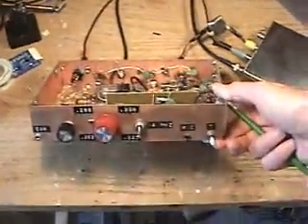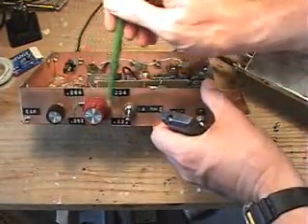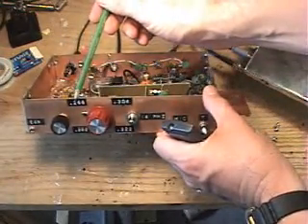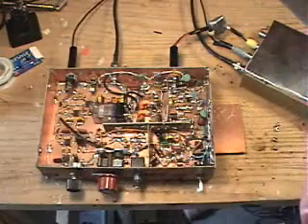And I found that gives pretty good frequency coverage. You can see that in one position it goes from 14.282 to 14.322 MHz, and then in another position the rig tunes from 14.266 to 14.304 MHz. There is quite a bit of overlap, but that's okay.